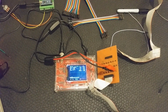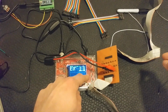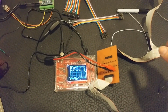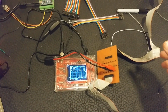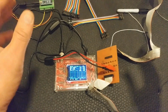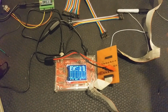Now the motor's turning at a half mile an hour, and look at that, already struck gold on the first pin. So can't really get the whole waveform in view right now. If we adjust the time scale though, we can. And it looks like we have a square wave at about 72 hertz or so, between 0 and 5 volts. Now all the readings here are not super accurate, because again, DSO138, it's a $30 oscilloscope, but for the sake of visualization, it's better than nothing.